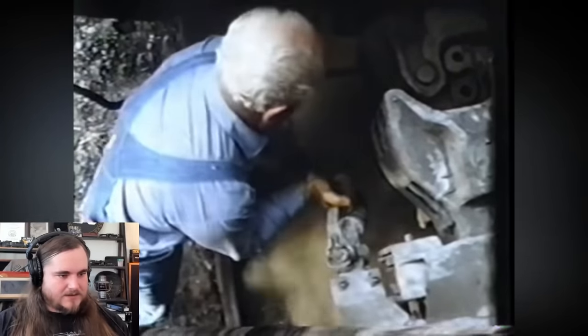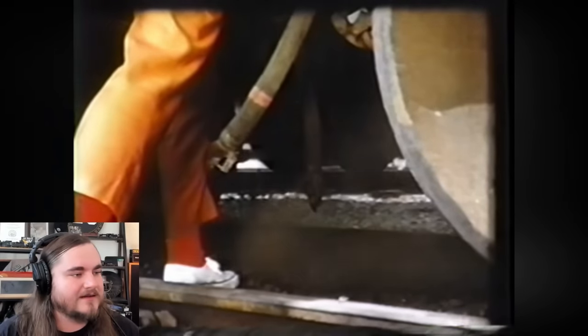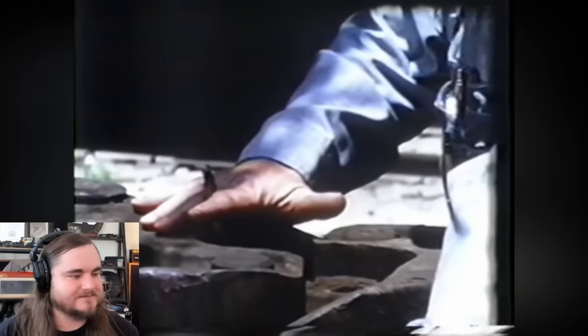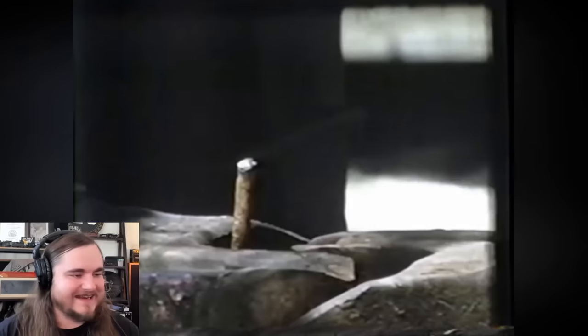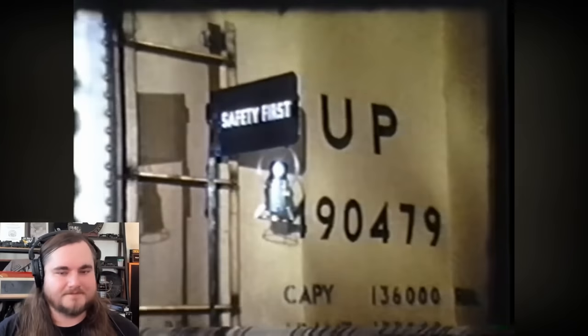Film: 'A glad hand can be a bad hand if you don't hold a hose when you open the angle cock.' Yeah, that's how you get your shin broken or worse. 'But the machinery between it and you certainly can hurt you. You've got to lean on the drawbar or knuckle to reach the one across from you. But don't put your hand or your side near an opening that can close. A car has to move only a couple of inches to give you a hell of a squeeze. Don't couple yourselves up - any part of you.' Great demonstration. And as of now, you know that this means don't move this car, this cut, or this engine - blue signal protection.